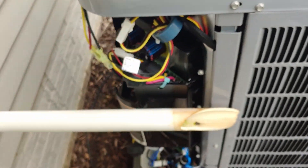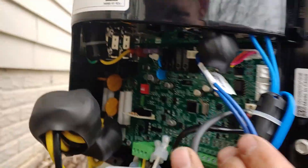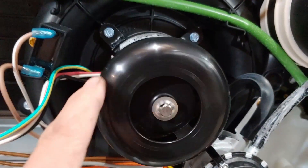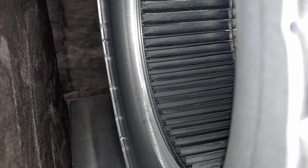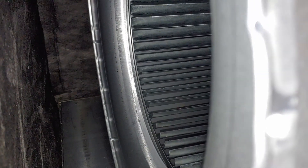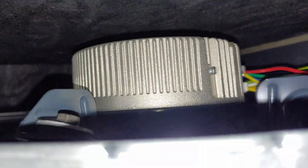It's crazy, way too complicated. Here's the indoor unit - surprisingly it just has a conventional blower motor, or combustion fan motor. Guessing the blower motor is going to be - yeah, this is an ECM blower motor. You can see it also has permanent magnets by the way it springs back. This thing actually runs on direct current that is mimicking alternating current, which is pretty crazy.